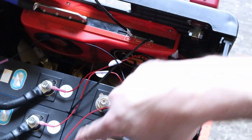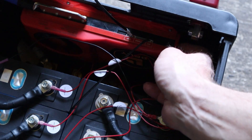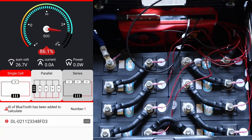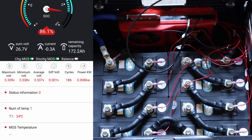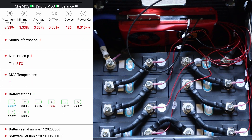Nervous excitement time now. I've rechecked all of the leads down to the plug and they're all on the right cells. Let's plug that back into the BMS and reactivate it. I've opened the app on my phone and it's already detected it. Clicking on there gives us a bit more information — overall voltage, remaining capacity. This is a 200 amp hour 24 volt battery. It's got max, min and average volts and the difference is virtually nothing, which is incredible. These are nicely balanced at the moment.